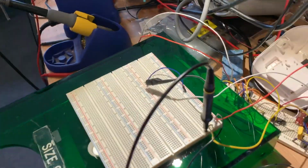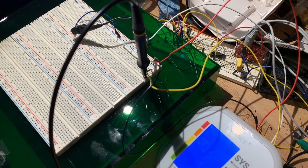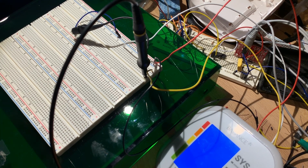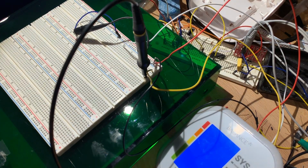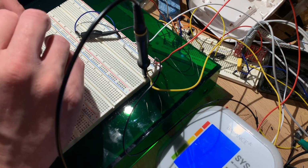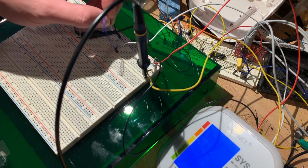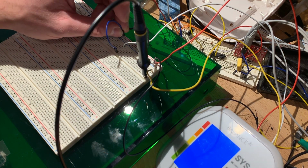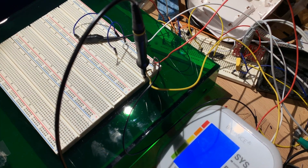You get to see all of my half-completed projects. All right. Let's see what happens if we tie chip select CS, I assume that's what it is, to ground. Let's see if that changes anything during boot up, or it gives me any signal right now. I'm watching the scope. Nada. Let's try off and on again.